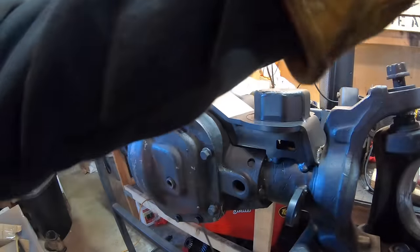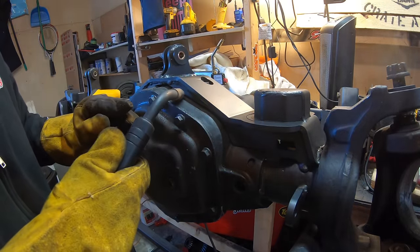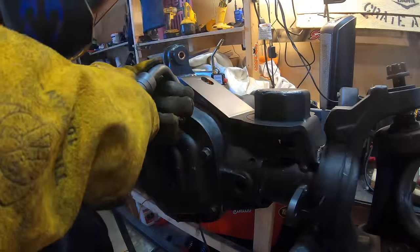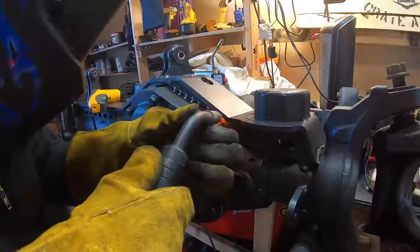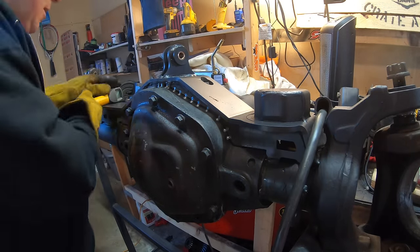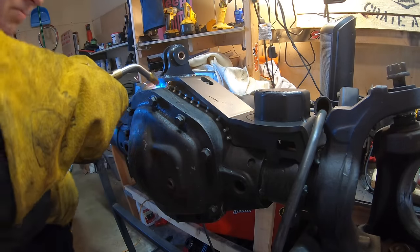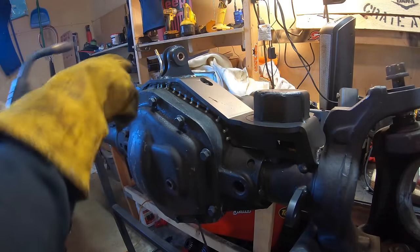We're looking pretty good — we're close to 400 degrees. What I'm going to do now is go ahead and make some tack welds all the way down, just because the gap is pretty large and having multiple tack welds will help us from blowing through the metal. Now that we have all those tack welds, it is time to go ahead and reheat it again so these don't crack.